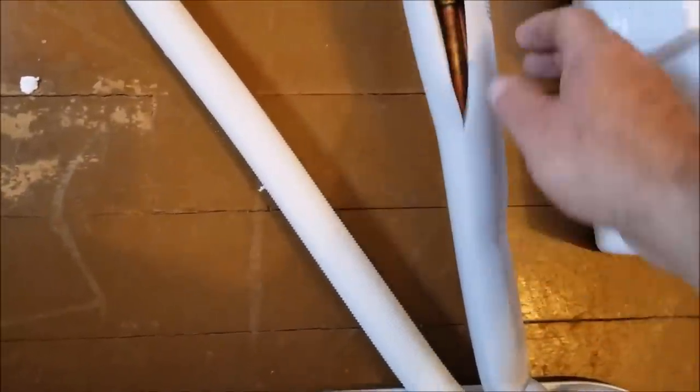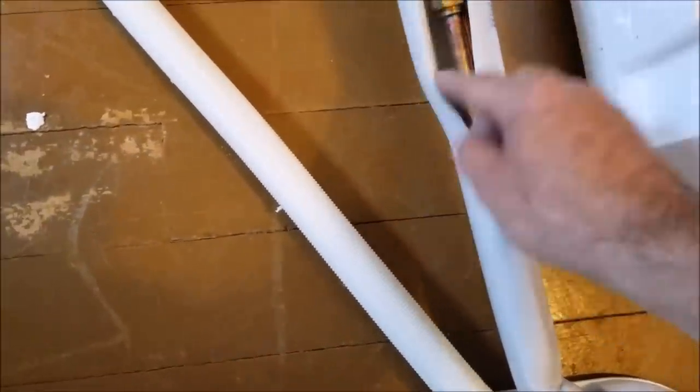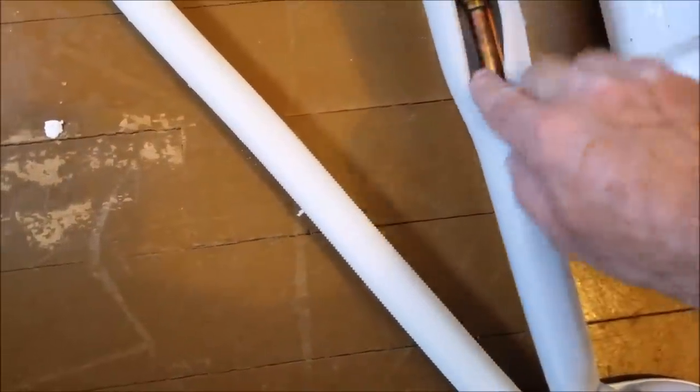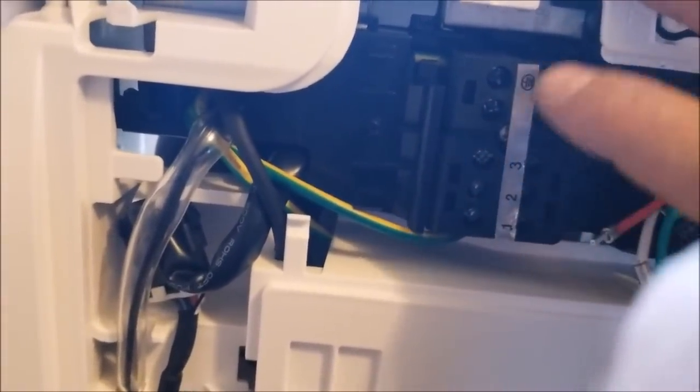When bending this, be a little careful — it's pretty easy to bend, and if you kink it the refrigerant won't flow through it well and it'll make it so the system doesn't work properly. So just be careful and try not to kink the copper line set. For the inside wiring, the front cover just pops up. It's got a little plate with one Phillips screw that comes off, and then the wiring feeds up to the front — it needs to come in right here where it's labeled 1, 2, 3, and ground.